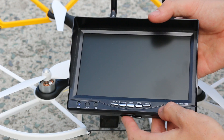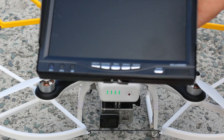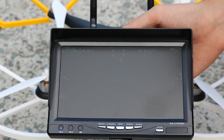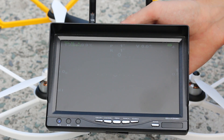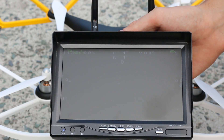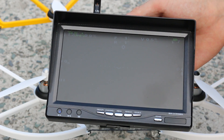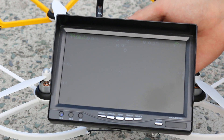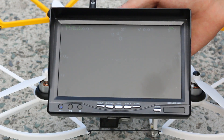The final thing is to turn on our screen. We're not getting a video signal right now because the gimbal isn't attached, but we are getting the readout from the mini OSD, so we can see data such as altitude, distance from the home position, and battery levels. This gives us a heads-up display as we're flying the Phantom so we know its location, how far away it is, and whether we have enough battery — which is quite important in this test because I'm going to give the Phantom an altitude test and see how high we can get it to go.